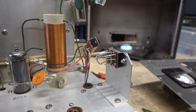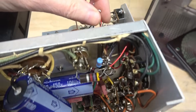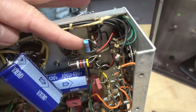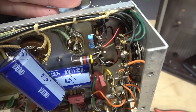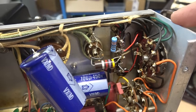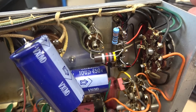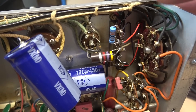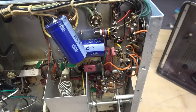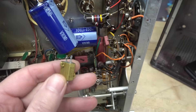I'll start by hooking up the plate shunt wires first. Tracing them down below, it's the red and black that go to the current shunt resistor. This one is a 33-ohm, which was the right one for the Navigator but the wrong one for the 6 and 2 meter. The proper shunt value for the 6 and 2 meter is 0.4 ohms; if you use a Ranger meter it was 0.51 ohms, whereas the Navigator with that old meter was 33 ohms — so this one has got to come out.